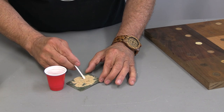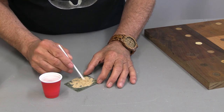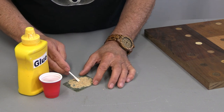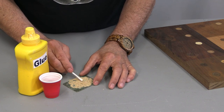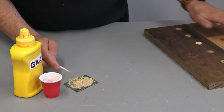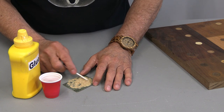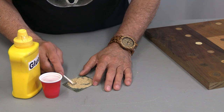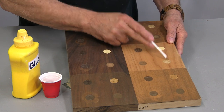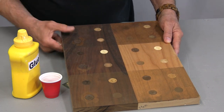Here's a bad idea when it comes to making your own wood filler: using sawdust. Some people take fine sawdust from their sander bag, mix it with glue, and end up with a globby mass they use to fill knot holes or cracks. The problem is that once the glue dries it becomes very hard and highly water-resistant, so when you try to stain or dye the wood, the surrounding wood takes the stain fine but the filler doesn't — the glue prevents penetration — and you end up with very light, white areas that stand out like a sore thumb.